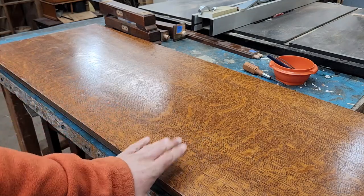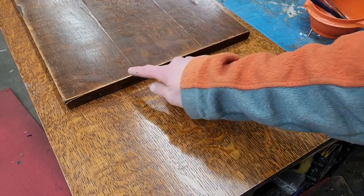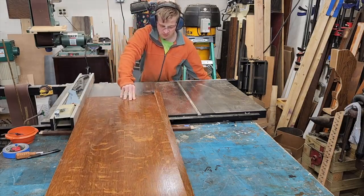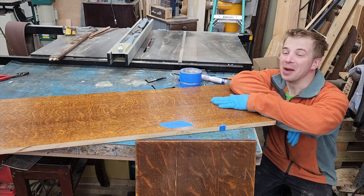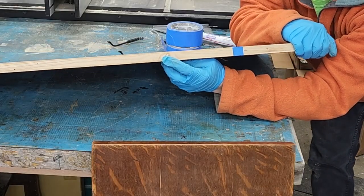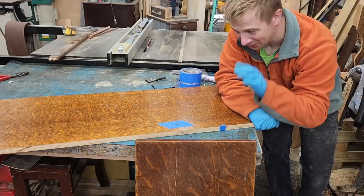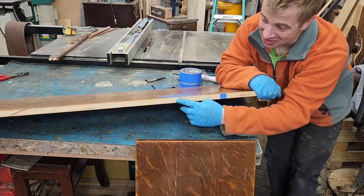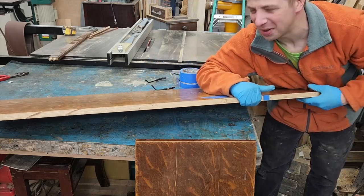I found this bottom panel from an upright piano in my above-ground landfill. It's got one veneer seam instead of two, so I'll try to land that seam in the middle of the cut. I've got my board cut to width and I'm happy with where the seam landed. I did encounter a surprise knot here in the core wood — nothing I can really do about that. I'll fill it with putty, and I'm really hoping I remember to put the hinges on this side so that this faces the piano. Between this issue, a couple wormholes, and some of my expert carpentry, there's a few issues on this side, but I think I can work with it.